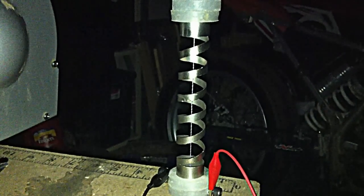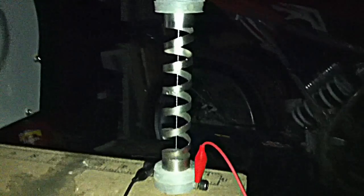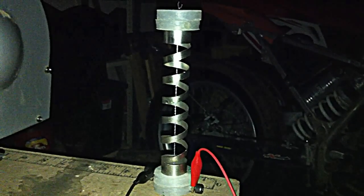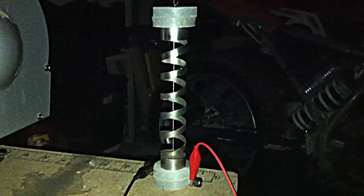I'm pretty excited that this design works. I thought that it would be a problem — I didn't think that it was actually straight, so I thought I would be having a lot of arcing issues. But I decided to try it without any adjustment, at the same voltage that the slot design was using, and I had one arc in the beginning, but that was it. It didn't arc after that. No adjustments necessary.